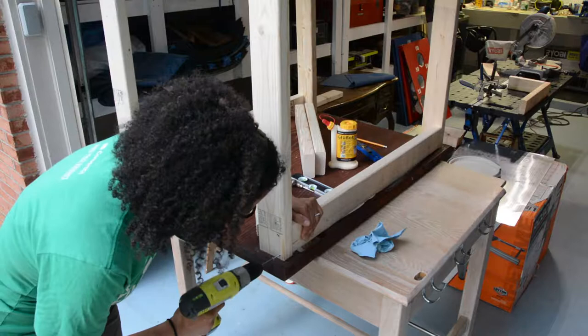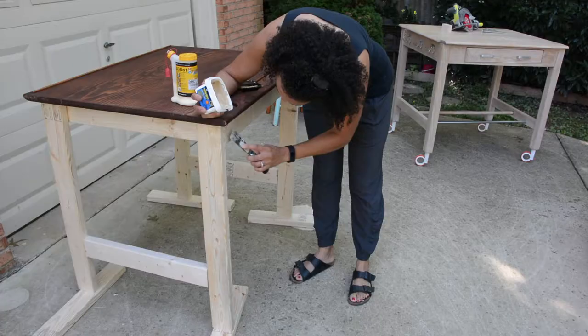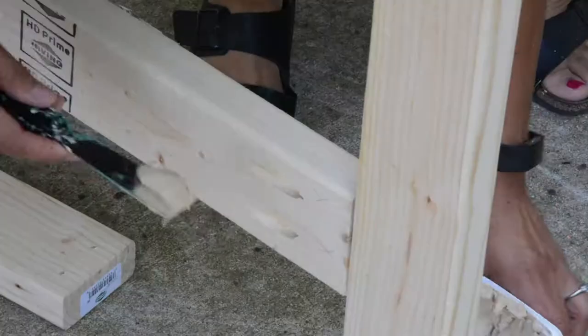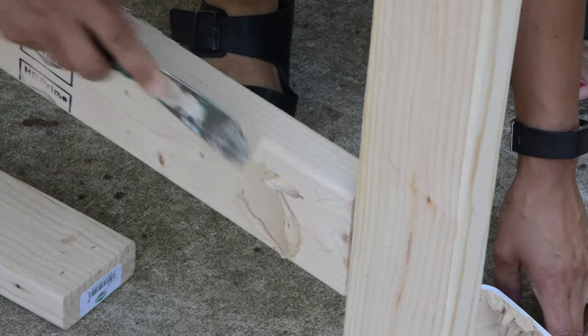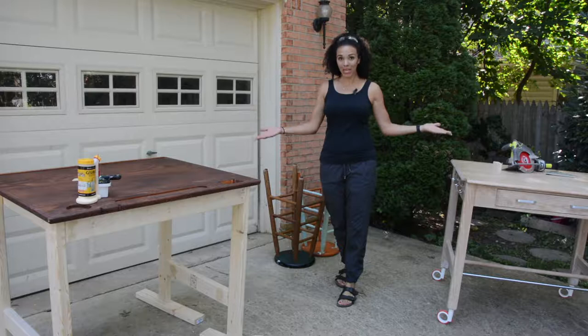The legs were a little wonky, but you know what? Doesn't have to be perfect. I used some pocket holes in order to secure the braces to the legs, and then used wood filler in order to fill them up, because when I paint this with Beyond Paint, I did not want that to show through. Okay, so we are 2/3 of the way done this project. We essentially have two tables from one table from the thrift store, from one drafting table. It's a little wonky.